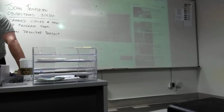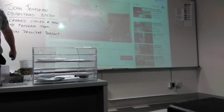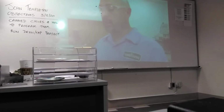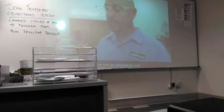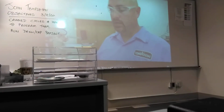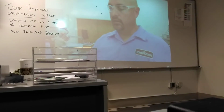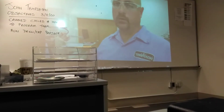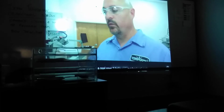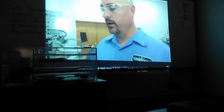I'm Mike Willis of NTMA, and today I'm going to show you how to use the boring head to bore the ID for a hole. The advantage of using a boring head is you can bore any size hole you want, basically. You can get different boring bars, do real little holes, and the boring head is adjustable. You can do real big holes. You can do oddball size holes, stuff you can't drill to size or can't buy a reamer for.